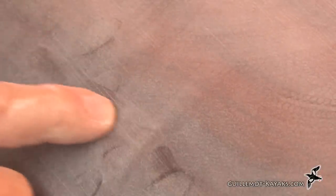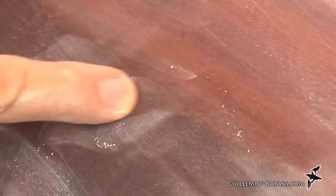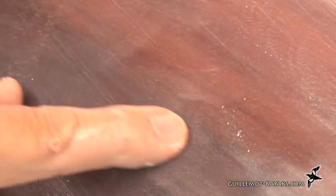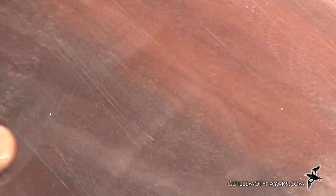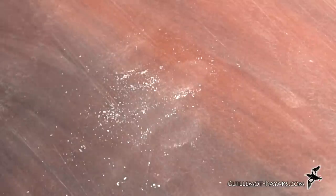So here you can see some of the 80 grit scratches left and we're seeing a little swirl in there — that would be the 100 grit scratches. I should have gone far enough to get rid of all of those 80 grit scratches. I'm not going to worry about it — I think they're fine enough and few enough that the clear coat will cover over them in the long run. The fewer scratches I have left, the better the clear coat will lay down. I'm going to throw in 150 grit and go over the whole thing, and then when the 220 hits it'll have a better chance of getting it down to nothing.